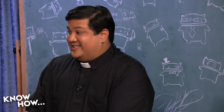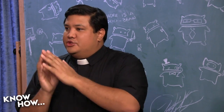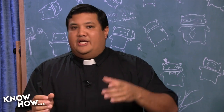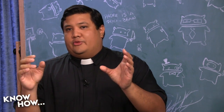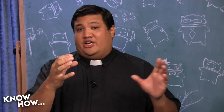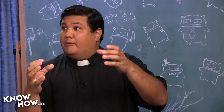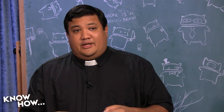Now, the way this works, we're going to get super geeky here. We should have a banner for Super Geek Alert. It actually uses what's called a PN junction, positive-negative junction. It uses the cathode and the anode that's been doped in a certain material so that when you run a current through it, it forces electrons out from the negative side. It forces electron holes out from the positive side. They combine in this PN junction, and Brian actually has a video that shows how this works.